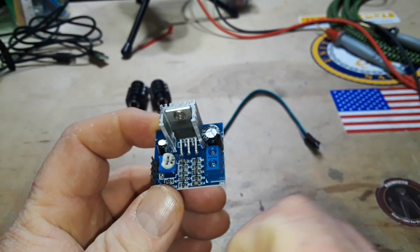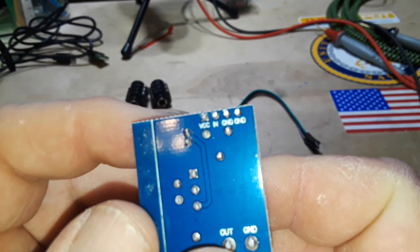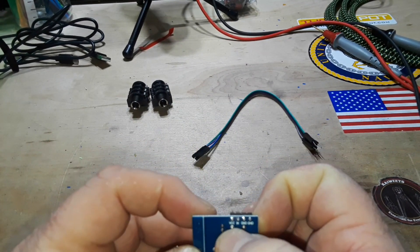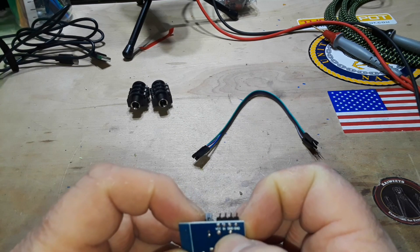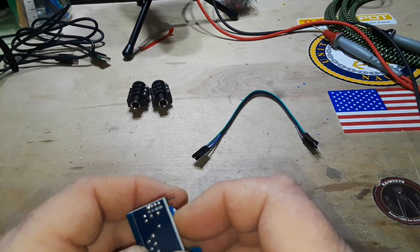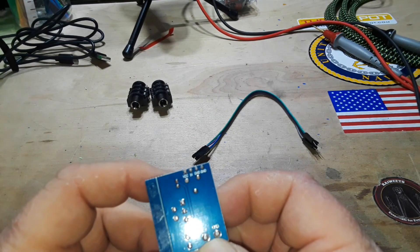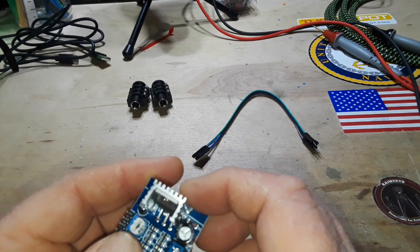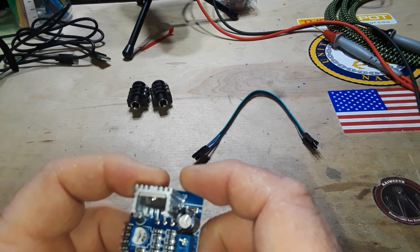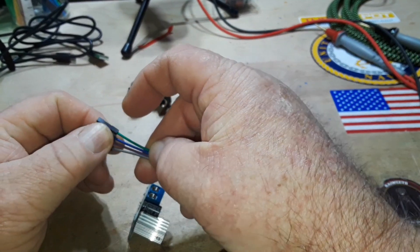If you look here, this is our input side. We have VCC in — our voltage supply — and then our signal input, and we have two grounds here: one for the signal ground and one for the power ground. I'll have to check if they're both shorted together. Over here on the other side we have our output and ground, and then we have a little trimmer pot, and it looks like we have an LED to let us know if there's any sound.